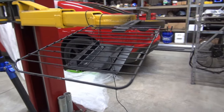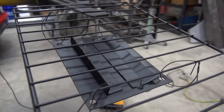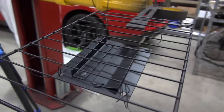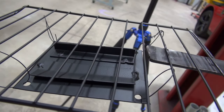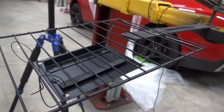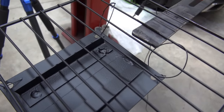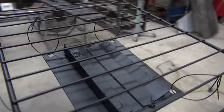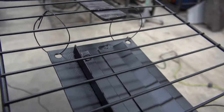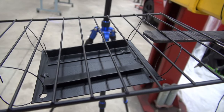Having a look at the first part that came off of the Harbor Freight system — just came out of the oven — and to be honest it doesn't look bad. Now, this is a matte powder so you certainly can't judge it on gloss. The one thing I do notice is that the powder seems smoother in some spots and in other spots it has kind of a rough texture to it. You can see it in the back left-hand corner as well. It looks okay. I wouldn't call it professional grade, but it's not bad.